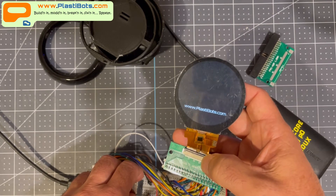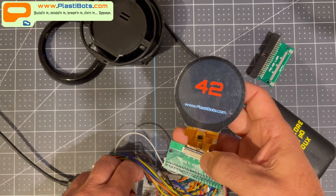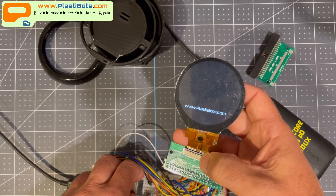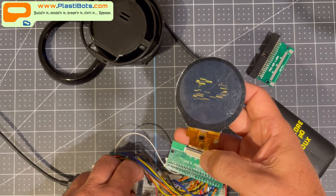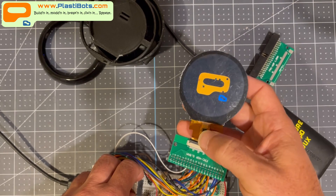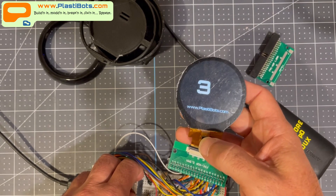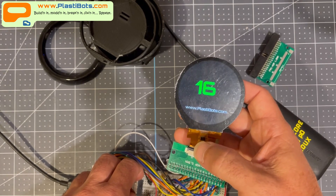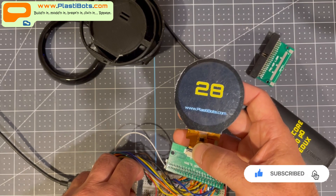My next steps are a couple of things: first, getting the ESP32 to talk to the V-Gate OBD2 reader, which has been challenging because it uses BLE and most available software uses standard Bluetooth. Second, I'd like to get the touchscreen working — the pin connections are already passed through, I just haven't tested the code yet. The codebase is quite large and takes about three minutes to compile. Stay tuned as I progress.